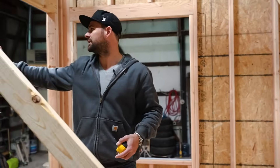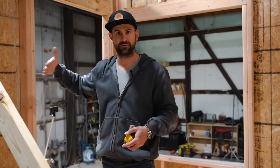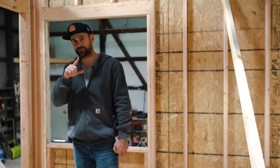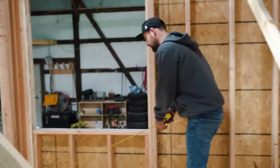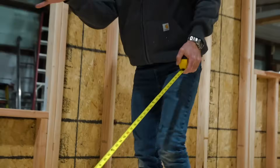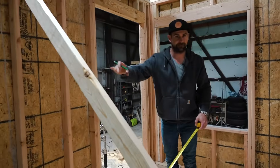So because this wall is over 10 feet, and this is the wall that we wanted to make sure was square, we're going to do a 6-8-10 because we're going to multiply by two. So the first thing we've got to do is make our six. I go from my corner — inside corner — and I'm going to measure six feet. We're going to make a mark right here at six feet. Then we're going to go to our wall that we're trying to square and make an eight foot mark.